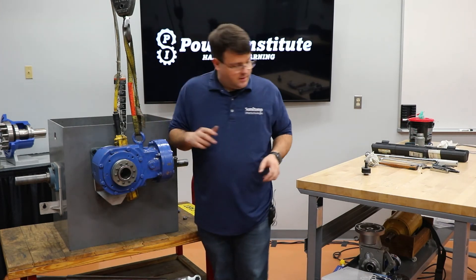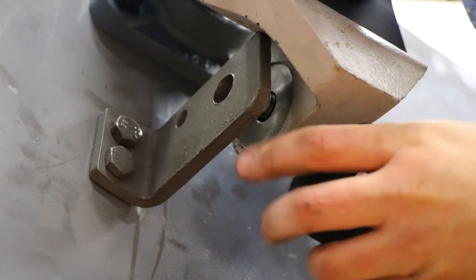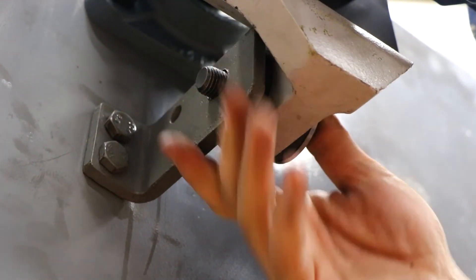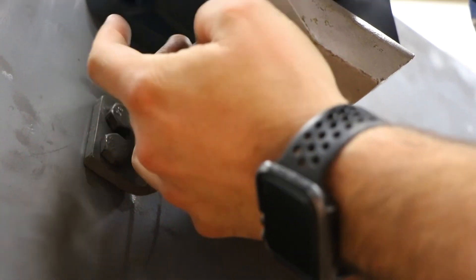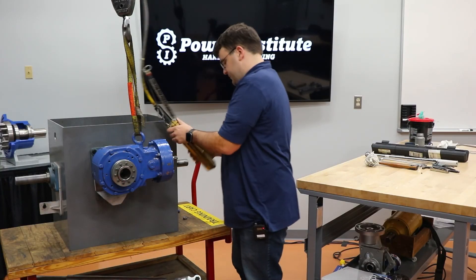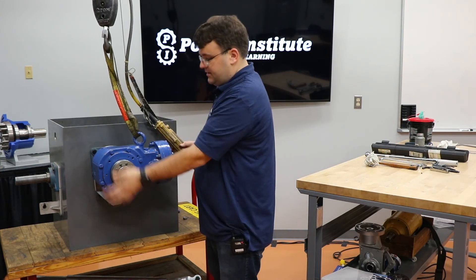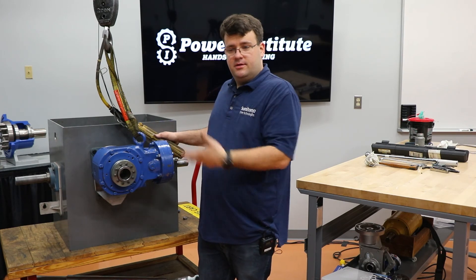We still have to do the torque arm itself. Same hardware as with the others: rubber bushing touching the torque arm, another rubber bushing on the opposite side, slide it through, flat washer, and then on the opposite side of the equipment, tighten it down. You should be able to move one of the two rubber bushings by hand, not with too much force. Once that's tight and secured, we can remove the weight from it. We know our shrink disc is tight, and we can go back and do our post-install inspection, fire up the unit, and we're ready to go. That concludes our install portion.